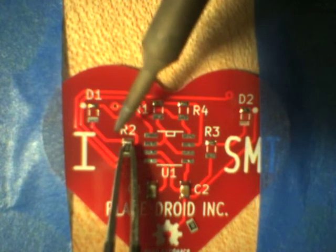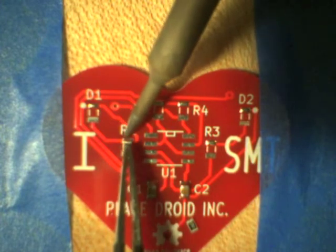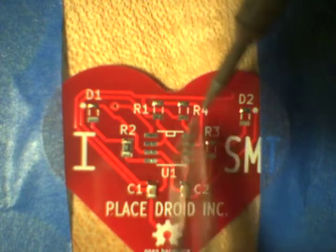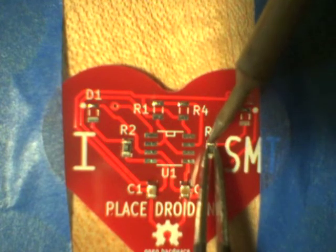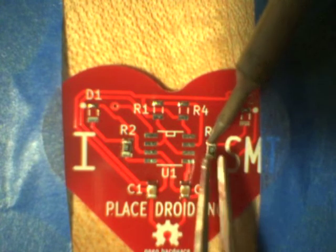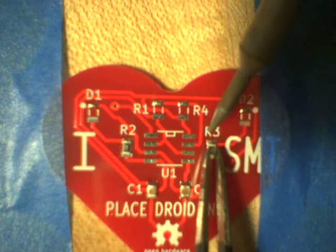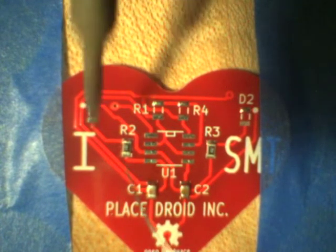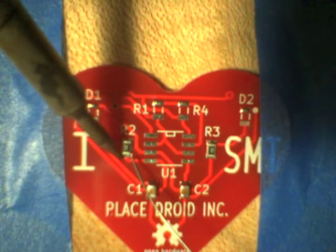I'm right-handed, soldering with the right hand, and see what I do there is I push down on the component. So once I've put it in place, I'll do the same with the next one here. You can hear a little click when it's in the right place. So what I do is I heat the end up. Now a bit of shuffling going on with this one. It's not always easy to get them in the right place. In fact, I come round to solder the other side of that one and I'm not happy with it, and I straighten it again.